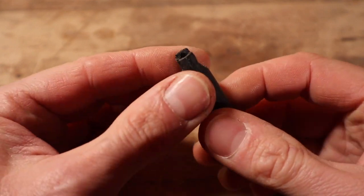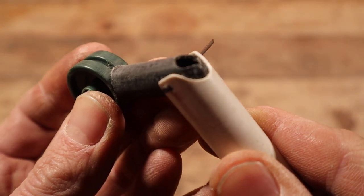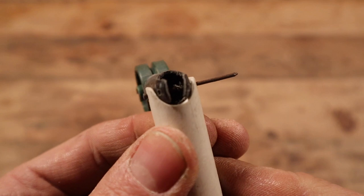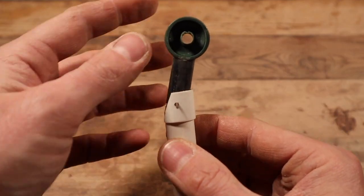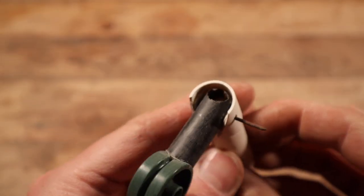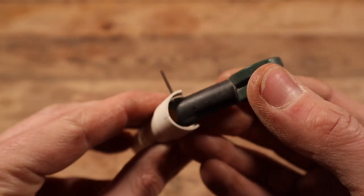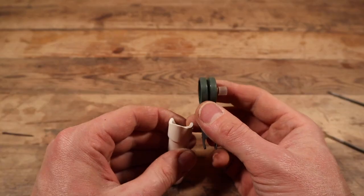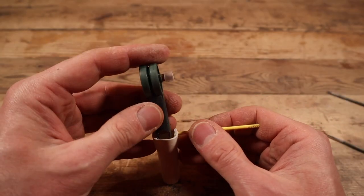I found out that leaving 2 long flanges at the end of the inner pipe, the black one in this example, they could push against the other pipe, providing much friction. But just because the pipes are hollow, this only works when the limbs are bent, and not when the limbs are in the stretched position. When stretched, they tend to wobble. Mamma mia! I'll solve this issue in another video, adding some filling into the wider pipe.